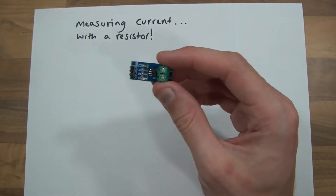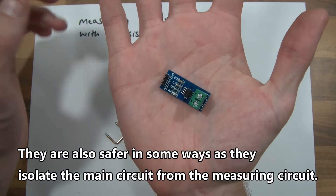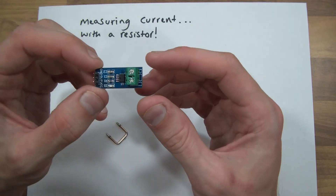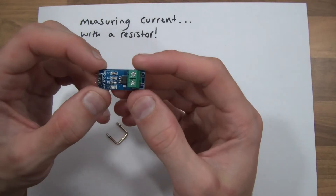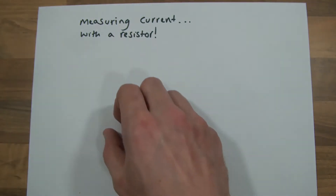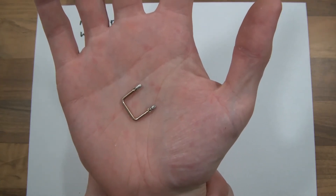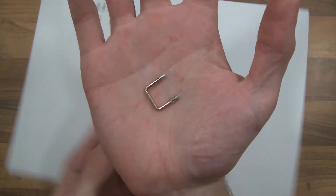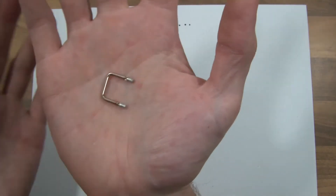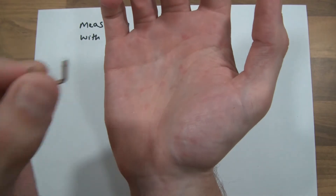So that's another way of doing it. But the differences between the two: Hall effect sensors are extremely efficient. However, I find them to be very unstable and quite limited — that's the major drawback with these things. Now, with shunt resistors, they're incredibly accurate and less limiting. The drawback is that the whole concept of measuring current using a resistor can be quite wasteful. But nevertheless, it's still a good way of doing it, so I'm going to show you now.